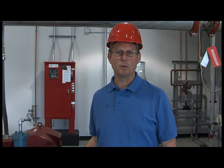What we just did was the electric pump test, and at each point, starting with zero flow, we record pump suction and discharge pressure, pump RPMs, and amps and volts. Then we went to 100% of capacity, which is 750 GPM, and we recorded pump suction and discharge pressure, pump RPMs, and amps and volts. And then we went to 150% of capacity, and we were flowing 1125 GPM, and we recorded pump suction and discharge pressure, pump RPMs, and amps and volts.